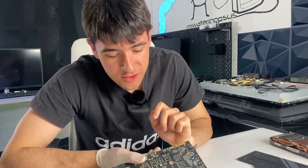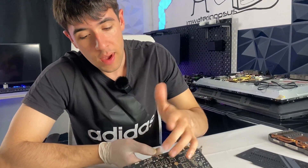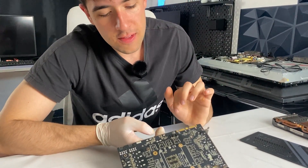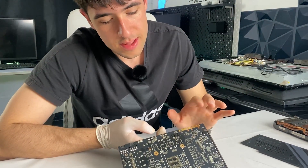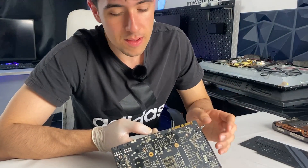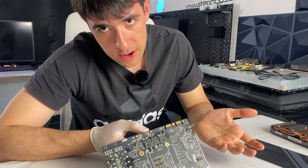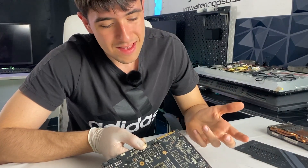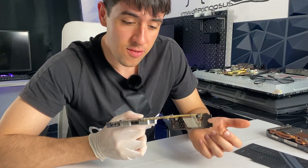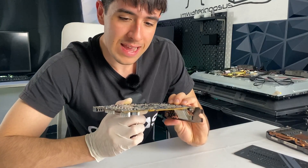The card is pretty much ready to be heated up now, but if you look closely you can clearly see where the memory chips and thermal pads have leaked, and the same on the VRMs. Sometimes this doesn't damage the GPU, but if the leakage soaks through the PCB, there's a very high chance it will damage it — which is why you should replace your pads regularly, probably once every three to four years. This card is about seven years old and it's never been done, and we can clearly see the results.